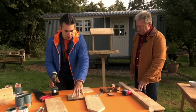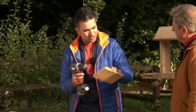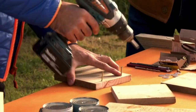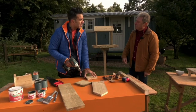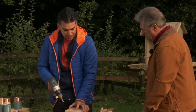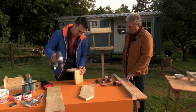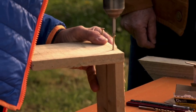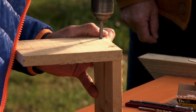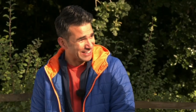Another little top tip: if you're drilling some pieces of wood together, pre-drill them. It's more tricky to hold two pieces of wood together otherwise. I've started these screws off already. I haven't drilled holes first because it's rough-sawn timber — it's quite soft and the screw will go straight through anyway. So I've pre-started them in, hold this into position, and then I can just screw this down. Slow and steady going forward. There is nothing more satisfying than making things — I think that's why I'm a carpenter.